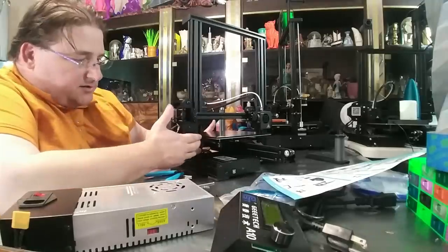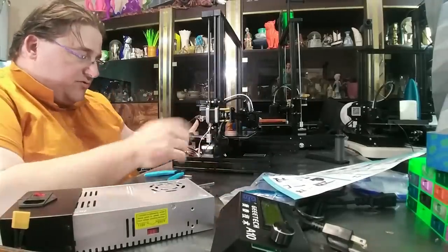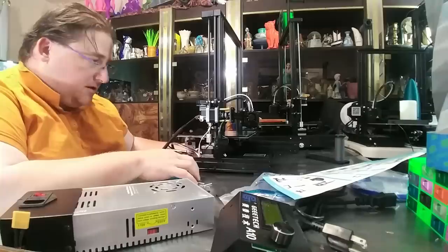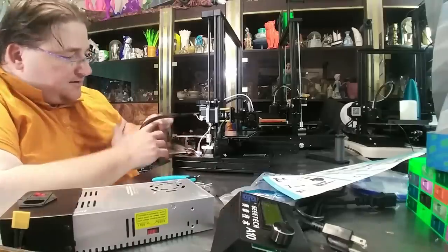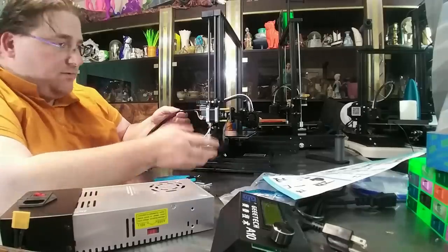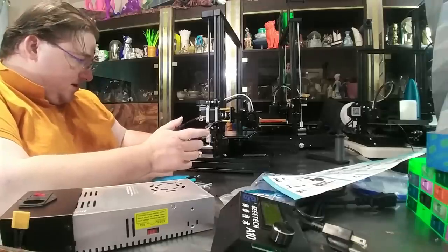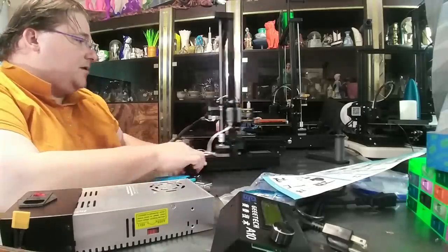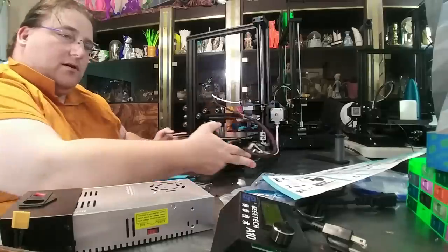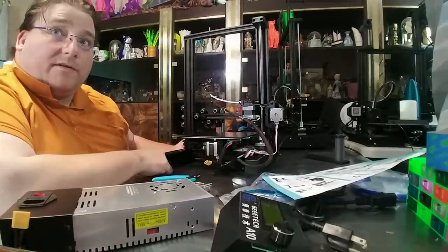The gantry is installed. Switches and steppers are all connected — pretty straightforward. I had to level the bottom because it was a little crooked. I like this assembly with the plug unified. I wish they would have unified the X-axis into this plug as well so they'd all be in a single plug — that would have been nice. Same XT60 connector for the power supply; that's the last piece to install along with the spool holder.